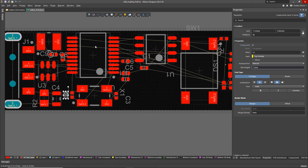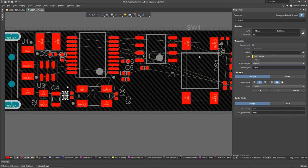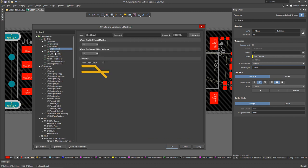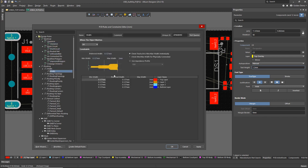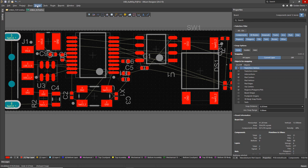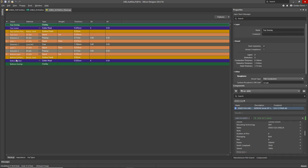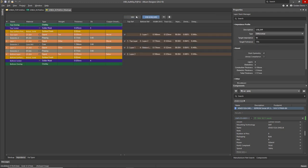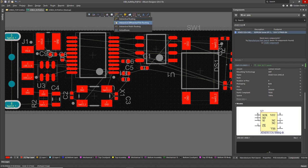Now what I need to do is start routing the board. I've already got design rules from the template — you can see we've previously set up our clearance rules. The defaults give you a basic set for basic board design, but I've already made this suitable for USB in my template. I've even added a differential pair rule with a differential impedance profile that suits USB 2.0. Here in the layer stack manager I've predefined the layer stack that uses OSHPark's four-layer prototyping service, with all the details according to their specifications as a manufacturer.